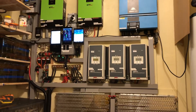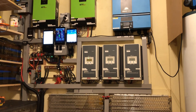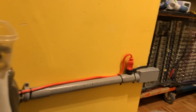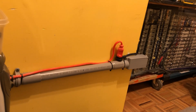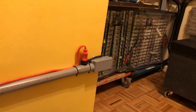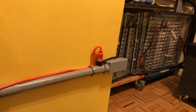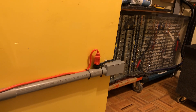So that's my system — it's 24 volts and 48 volts in one, but the batteries are split up so things can work. Those are the wires coming down from the grid. The wiring in here is also upgraded — I originally had 8-gauge wires, now I have 6-gauge wires. I have four wires coming down from the main panel for the house — two live and two neutral, likewise a ground.